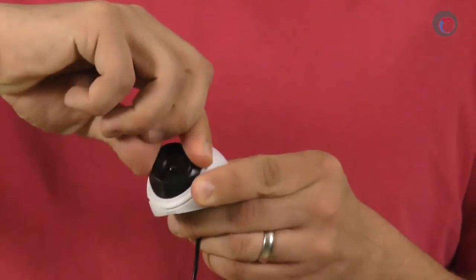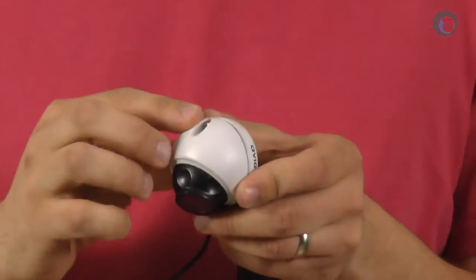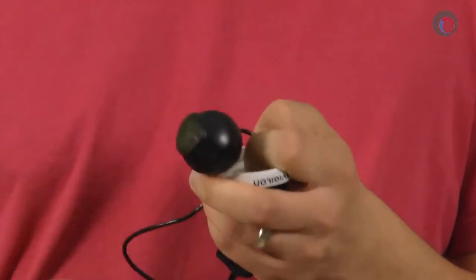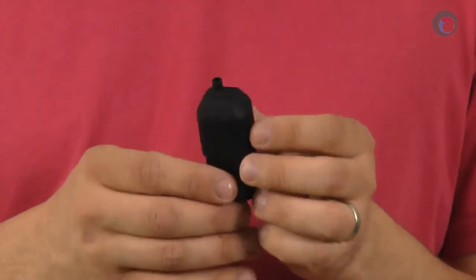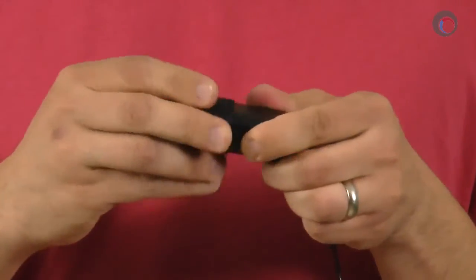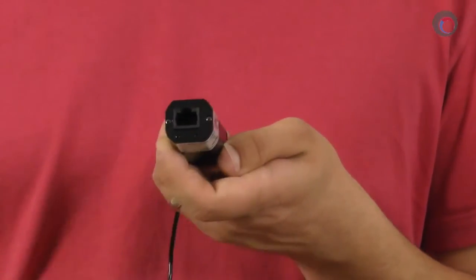You can use that black housing to roll around inside of the white cover to aim the camera. If you remove the security screw on the back of the unit and open it up, you'll see that inside there's really not much else to it. Flipping to the other end of this wire, you'll see that the connector for the camera has a rubber sleeve on it for its IP66 rating. If we remove that sleeve, you'll see the Ethernet jack inside as well as a small reset button and your activity lights.